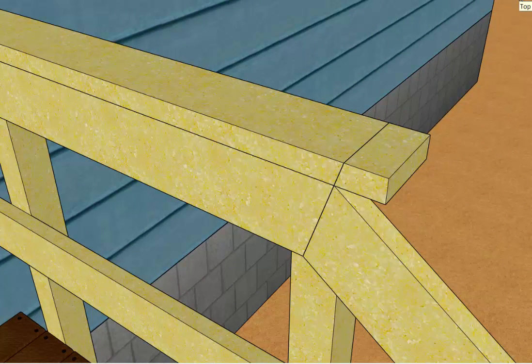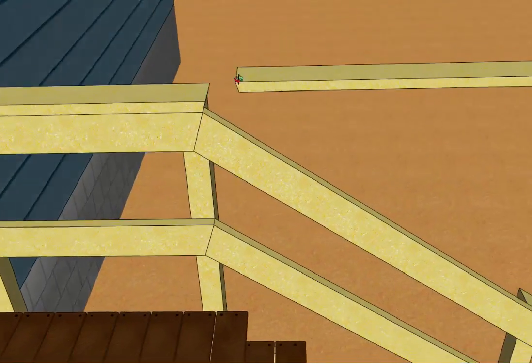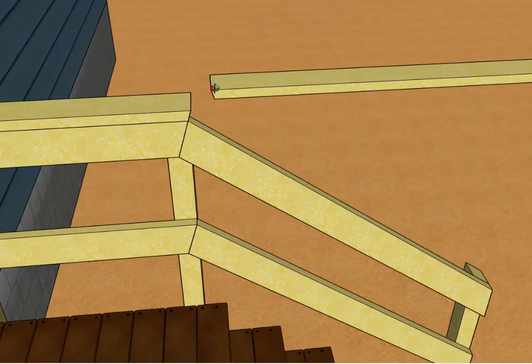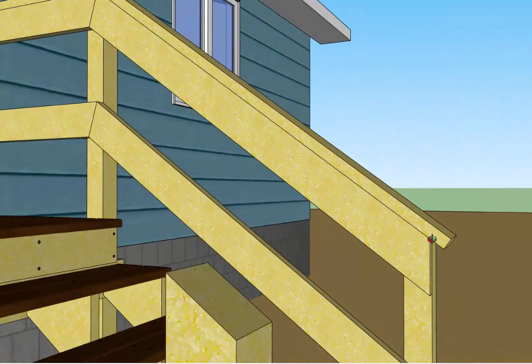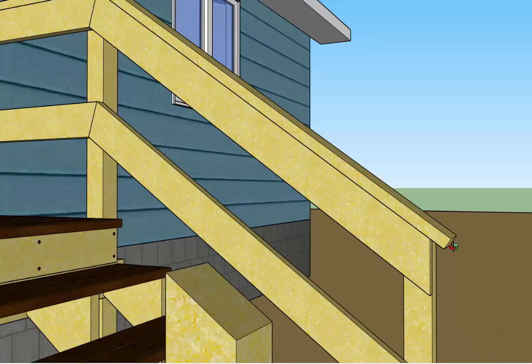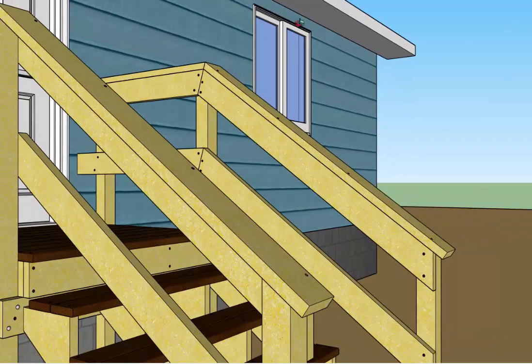Go ahead and cut that off and install it. Then use that exact same angle — 17 degrees — to cut off the end of a board for the other top cap. Lay that board down and if you've done all of this correctly the angles on both sides should be exactly the same, so install it. Down at the end of the stair, make that board just about an inch and a half to two inches longer with a nice square cut, and that gives you a pretty good finished look for your porch rail.